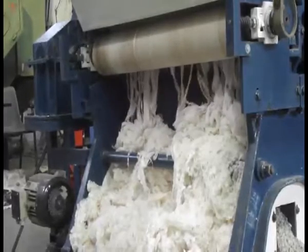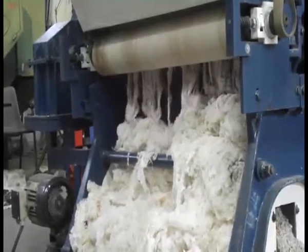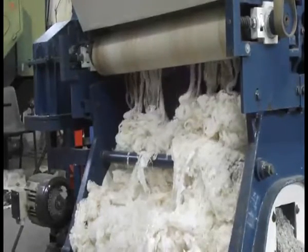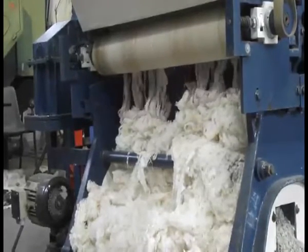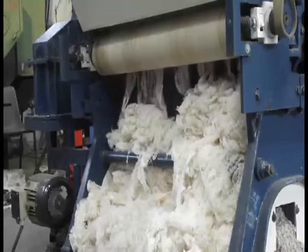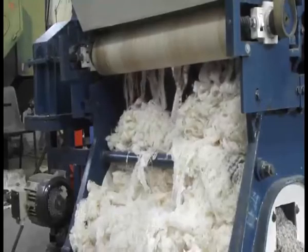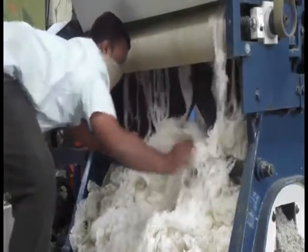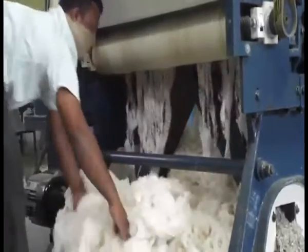What was this research for? At present, chrome leather rollers are used in these machines. These chrome leather rollers, while ginning, emit very high amounts of chromium compounds into the atmosphere. Chromium is a carcinogenic material. Studies have indicated chromium contamination to the tune of 100 to 1,000 times more than the allowed limits in cotton and in cotton seeds.